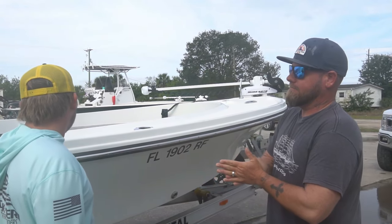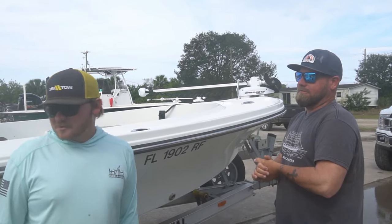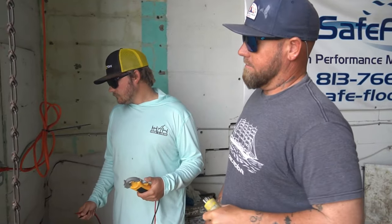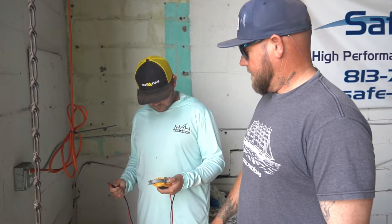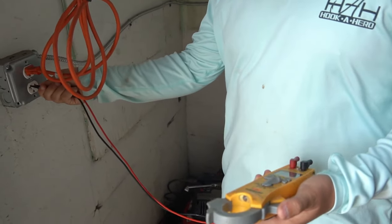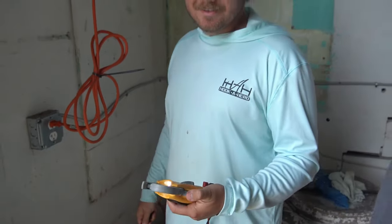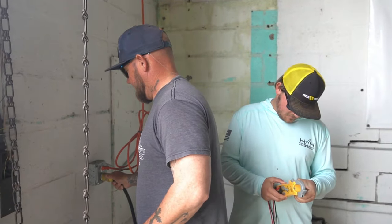So where are we going to start, Caleb? Let's start at the building and check power — make sure you're plugged in first. All right, step one. We are here inside the building at the source of our power. We're going to check the outlet first — I'll feel really dumb if there's a breaker flipped. We're looking for 120 volts. The tester showed 117 volts — that's just a low battery in the tester. So we know we've got 120 volts to the outlet.